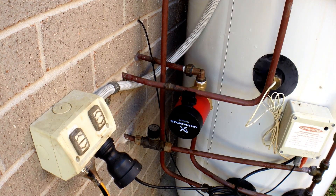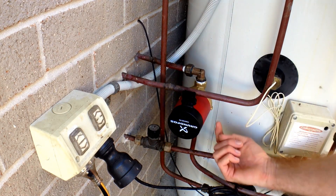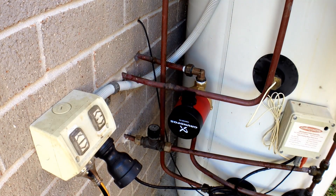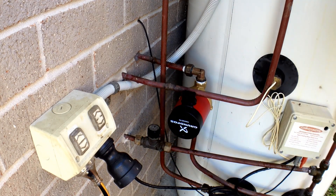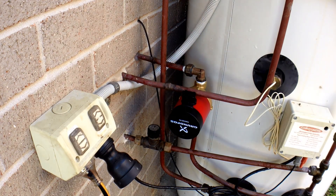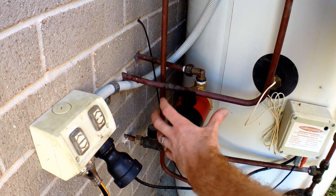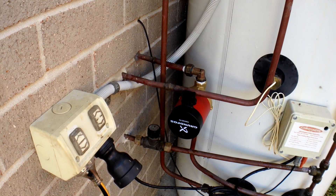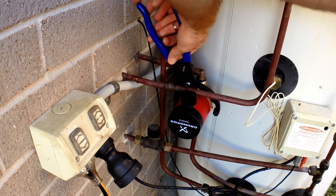So that's the pump fitted back into the system. Now you'll notice that when the pump is pumping the right way from the tank up to the roof, the actual body of the pump is upside down — electrical connectors at the top exposed to the water, the writing is upside down, the drain hole in the unit is at the top. If we leave it like that we're going to have a bad time, so we need to turn the motor part of the pump around. That's really simple — you just need to undo this big brass retainer and the pump body will spin around.